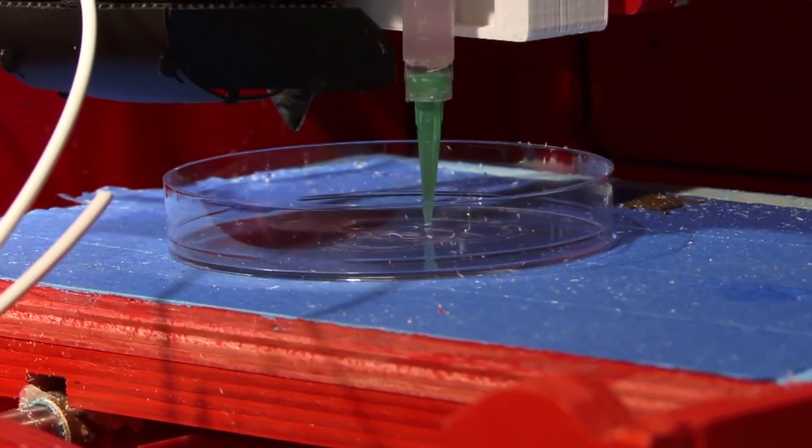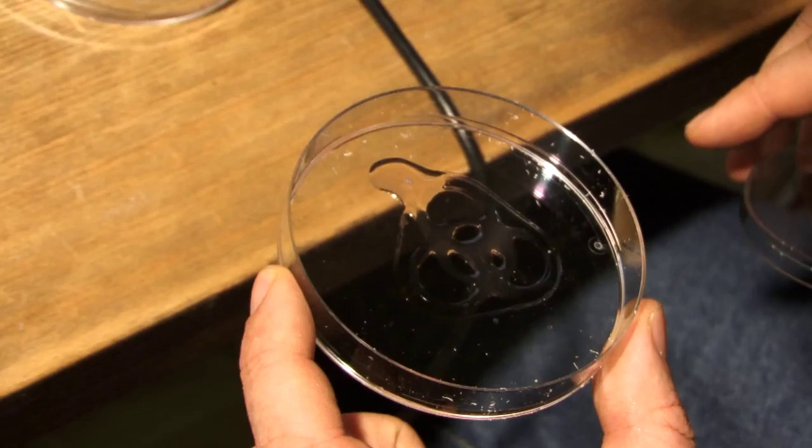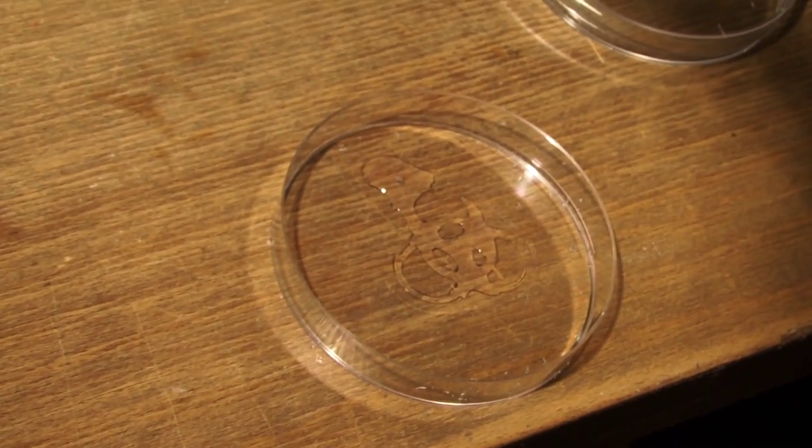It's supposed to make three circles — and the other one. I didn't have the end stops configured on this machine and it didn't have a lot of stuff set up. It tried to move much faster than it could, so now it lost some steps. Oh, it ruined the drawing. It was supposed to make a biohazard sign — four circles. Not perfect yet. That's the problem with lots of people, and also me: we want it to be perfect the first time. It won't happen. The goal is to do any printing at all.